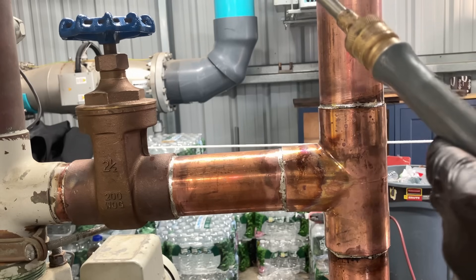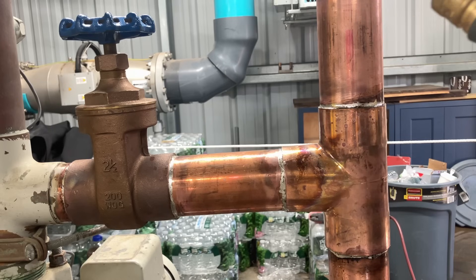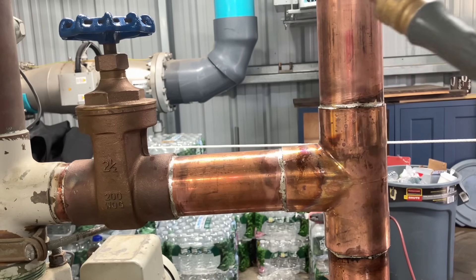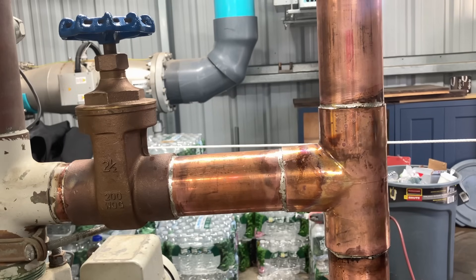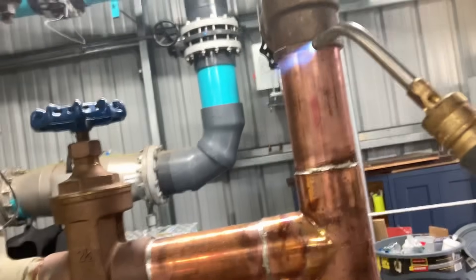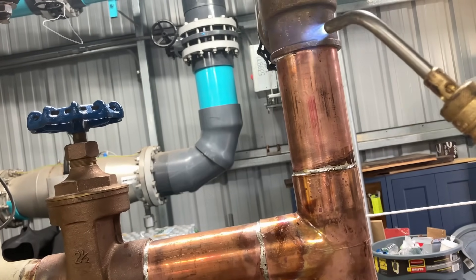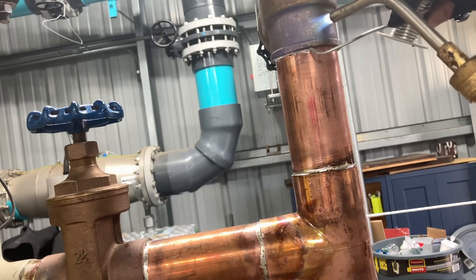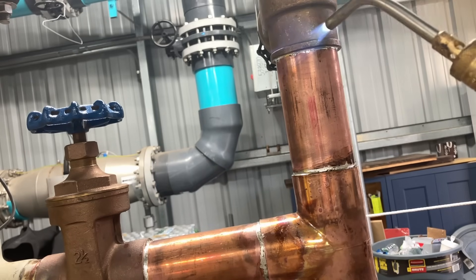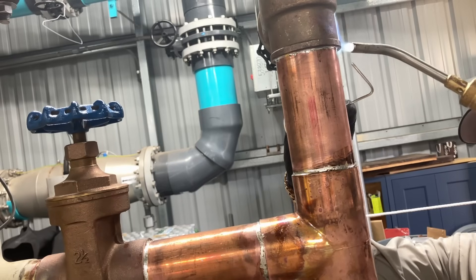This cast brass or bronze is going to be the hardest to solder because of the extreme heat that it needs. I'm going to focus my attention on heating up the entire joint where the copper slides into the cast of the valve itself. My B-tank is almost empty — will I make it? I don't know. If I have to, I'll grab my brazing kit in the truck. But we're just starting to take, and the solder will go to the heat and get sucked into the joint. If it's too much, obviously it's going to run down, but the solder will definitely suck into the heat.